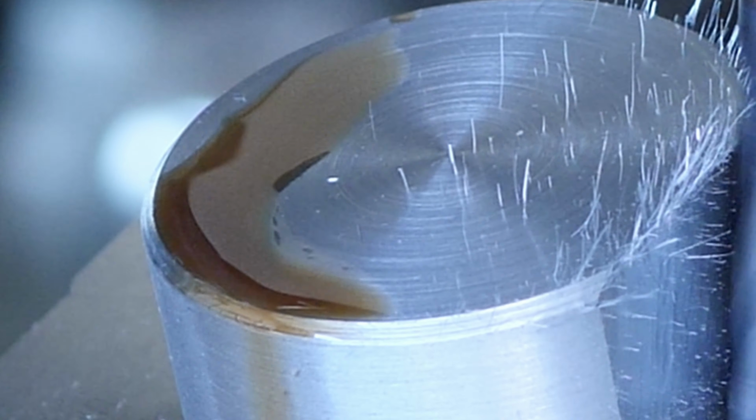And though Gordy is in remarkably good condition, she isn't perfect. You may have noticed some brown oil in the fly cutter portion of the video. That's because the spindle oil is leaking. Probably a worn O-ring that I need to replace. Other than that, however, she is working great. The ways and screws all feel fantastic.